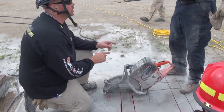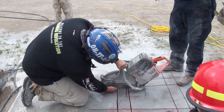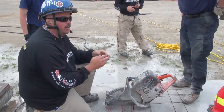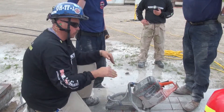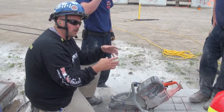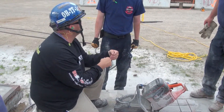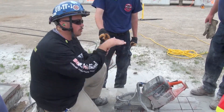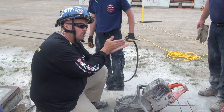When you look at these cuts, you can see he got right to that edge and got the full depth of these blades. When you guys cut over here, you stopped about an inch and a half to two inches short — that's going to hurt you when we start chipping these out, because you won't get that full depth of that trench all the way out. You'll either spend extra time chipping or you'll have to fire the saws back up and recut them.